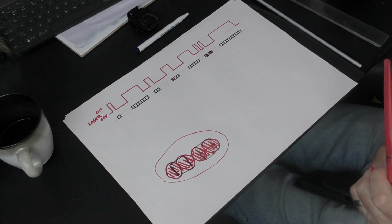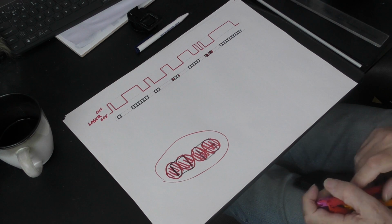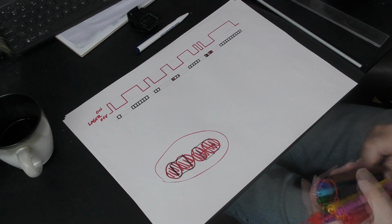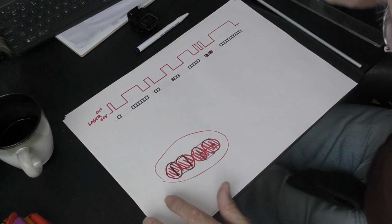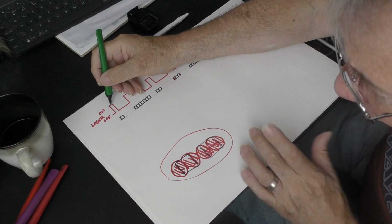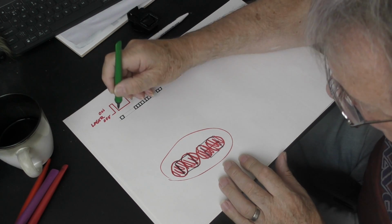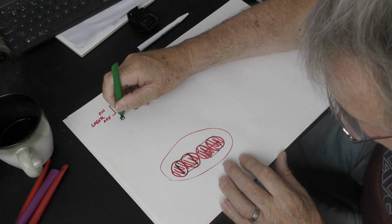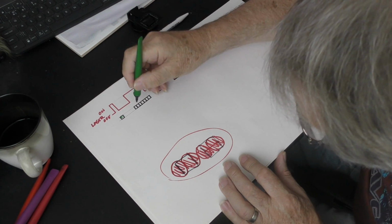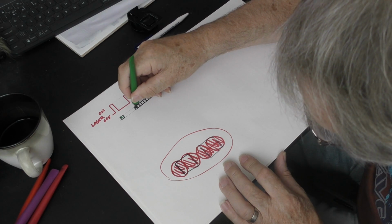I've never been able to get it on a fiber laser machine either, until I discovered a wonderful feature in the fiber laser machine called drill mode. And drill mode basically means this. The fiber laser comes along and it says, there's a pixel there. Stop. Then it moves along and it says, we've got another pixel here.